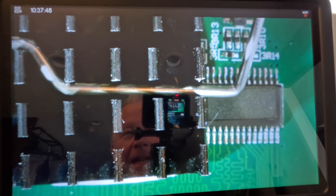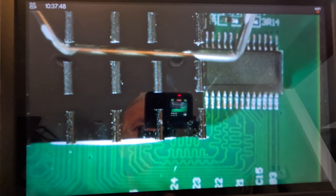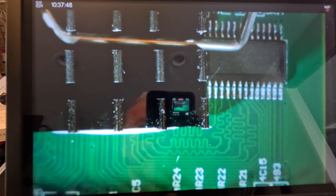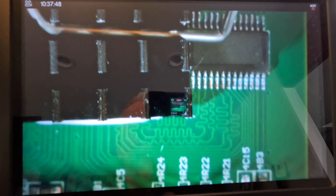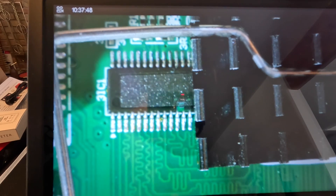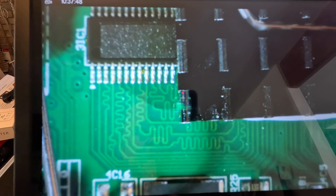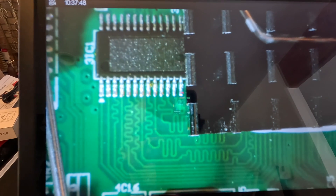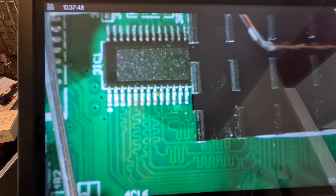Check out the chips - it looks like the part numbers have been rubbed off. But look at the fine trace work underneath. They've matched the length of those pairs - they are differential pairs, so the impedance is the same. You can see those traces running across the board. This ensures both traces reach the pins at the same time, and each differential pair is also matched in length to the others.